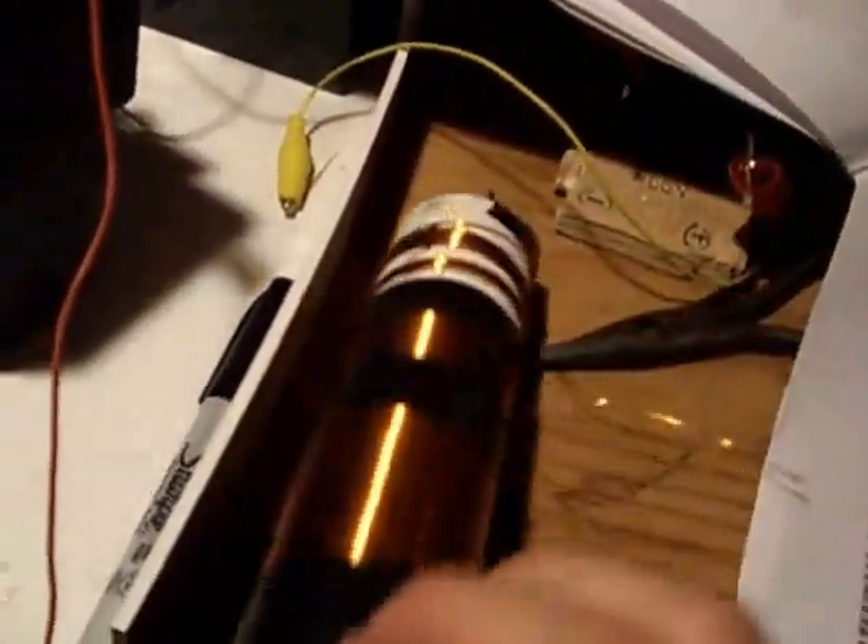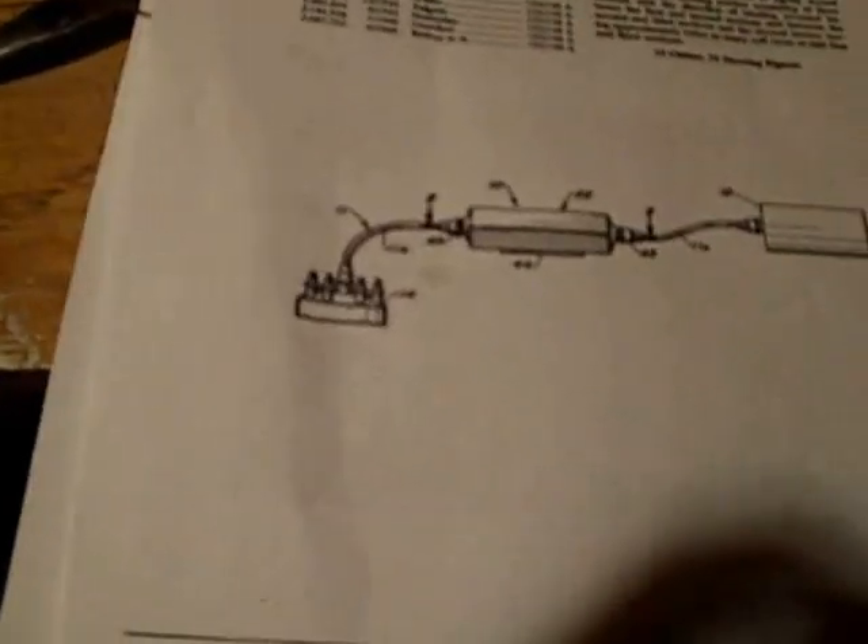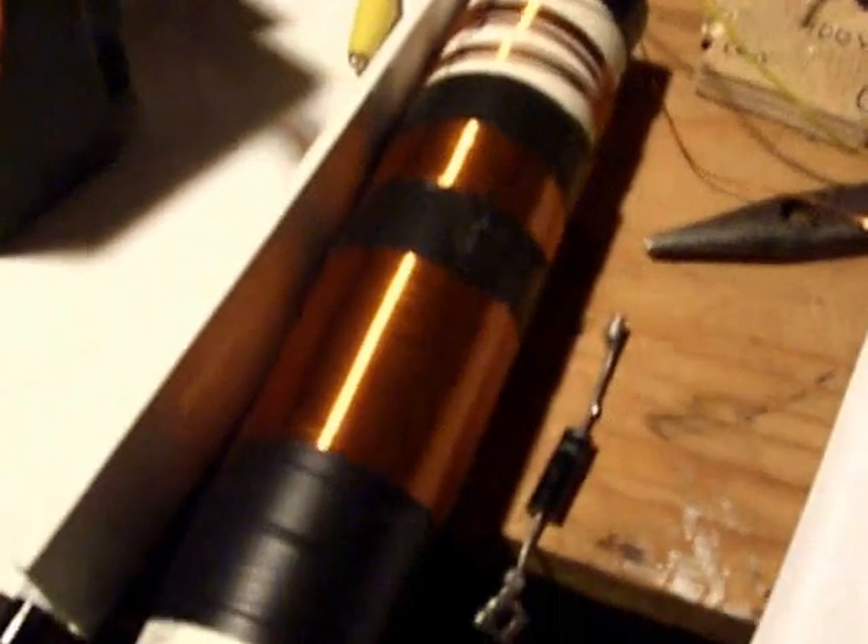The preferred device has a core diameter of one and a quarter inches and is wound with 22 gauge magnetic wire. Wood is not suitable for the core since it usually contains moisture. He didn't indicate whether a solid core or plastic tube works better, so I'm going with a plastic tube — about $3.50 for five feet. That's pretty much the whole patent. Peter pointed out it's too simple not to build and try out. Your hand will be hurting after a few minutes of winding, but after that you've got it. Check it out.